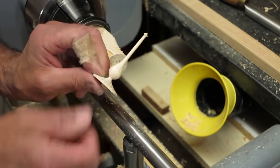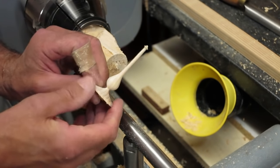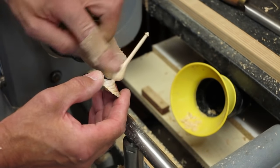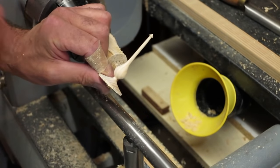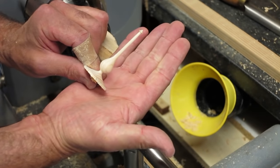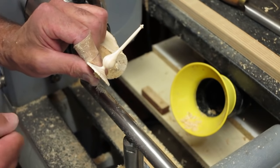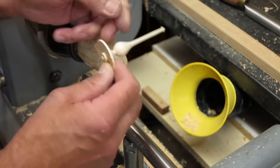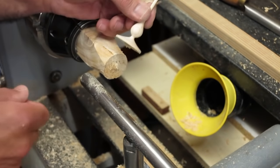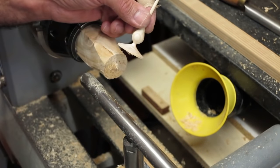The whole idea of this video is to show you the basic method. Take a rough piece of wood — if it breaks, it doesn't matter, nothing lost. Obviously the lines on this finial need a lot of work, but let's pretend this is your first finial and you've got that far. Now you can start to practice and refine your technique. You can add little fillets and nuances as you require. You have the tenon there — put it away safely, and when you've done a box or whatever, you've got a finial ready to fit.